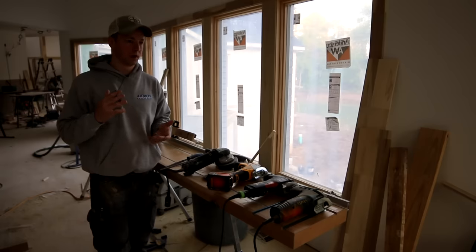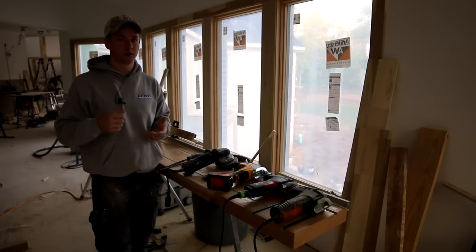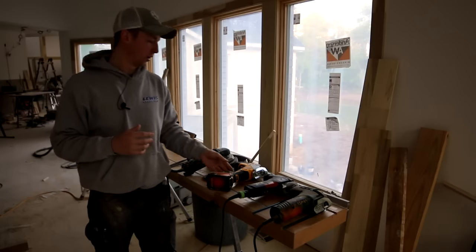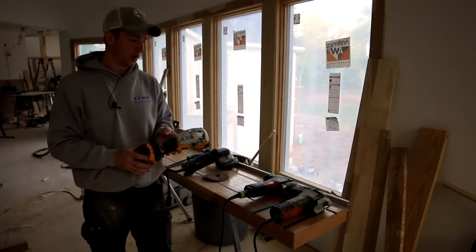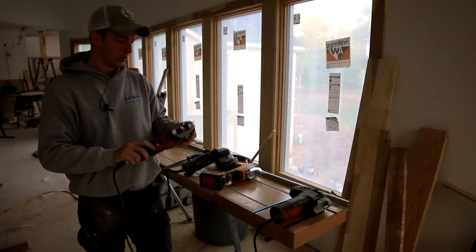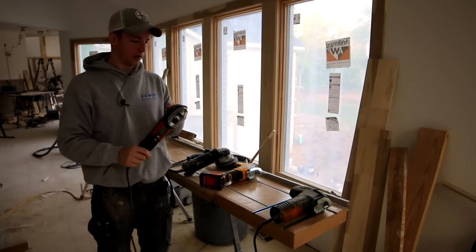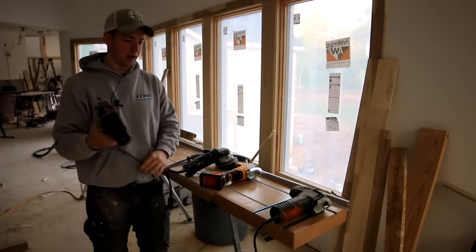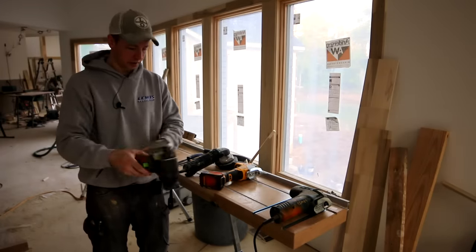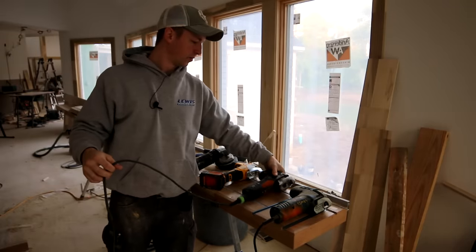The first time you get into a really large crown or hardwood crown, a hand coping saw is just a tremendous amount of work to really produce a lot of copes. That is where I feel like a jigsaw really shines. This is a Festool — I think it's a 300 EQ — and this is the jigsaw I've used to cope for a really long time. It's very smooth and I really like it. But within a couple hours of coping, you've turned this thing around so many times that the cord would just end up being a disaster.